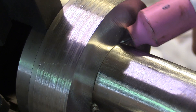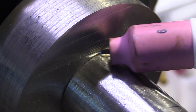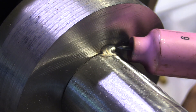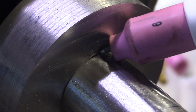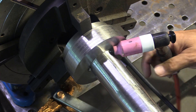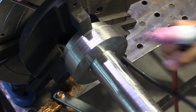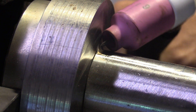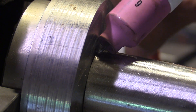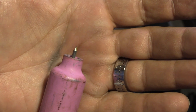I have a few pieces of free machining 303 stainless and that's what I'm using today. It's not really recommended for welding and we'll talk about that as we go. There are lots of different size cups that would work on this root pass, but at the very least I need a large enough cup that it won't bump on the tack welds. A number six seemed about right and it'll save me gas — I can easily get by with 12 to 15 CFH with this number six cup. I'll go to a bigger cup as I progress and increase the gas flow a little bit.